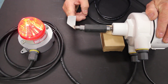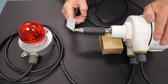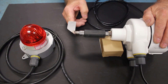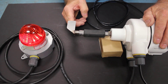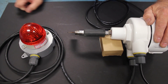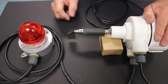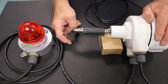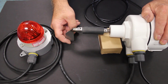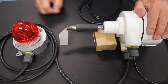If I stop this paddle from rotating, there's about a one-and-a-half to two-second delay and then the light will turn on. This is a flashing light — it's not the BMRX causing it to flash, that's just the style of light. When I let off the paddle, the light will shut off and the paddle starts turning again. If I stop it again, after about a second and a half to two seconds the light turns on giving a covered indication; then we let off and let it rotate.